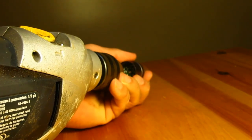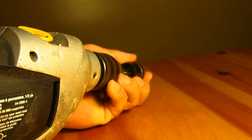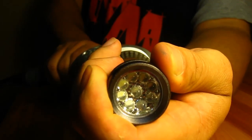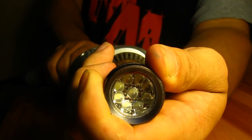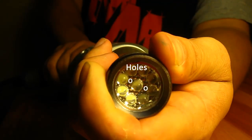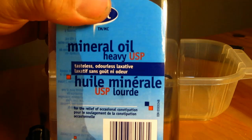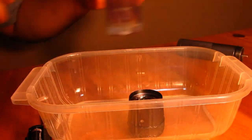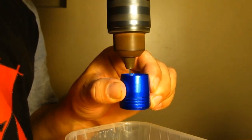Disassemble the flashlight and drill two small holes through the circuit board to provide passage to the front LED area. Be careful not to damage the copper traces, and also be careful not to drill through the front lens. We paid a few bucks for this bottle of mineral oil. Since it is a laxative, we can safely say it's non-toxic — just don't fill the flashlight and lick your fingers right before you put your wetsuit on. Pour some oil into the head of the flashlight. You'll notice the oil is too thick to flow through, so run your drill in reverse on one of the holes and it will turn into a crude pump.